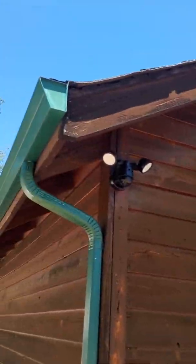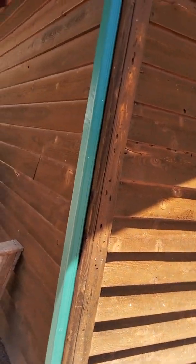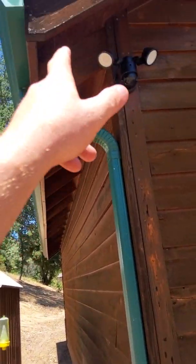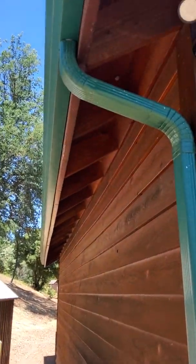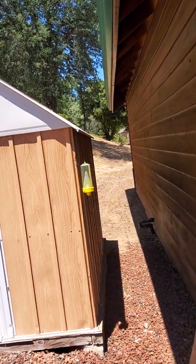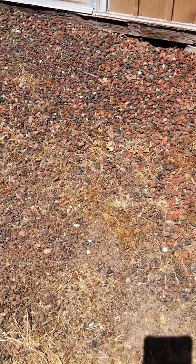Wrapped around fascia, you can see fascia members here, and they cut the corner down here where it meets the fascia behind the gutters. Wrapped around fascia is important because these are all rafter tails. This is a cut and stack roof. You can tell by the 2x8, because if they were 2x4, most likely they'd be a truss system. It's a really good thing to have, because it keeps the gutters well intact and keeps the tails and the fascia at the end from twisting. So it's always good to see stuff like that.